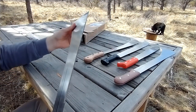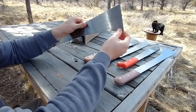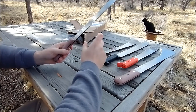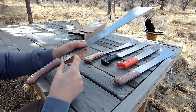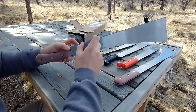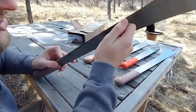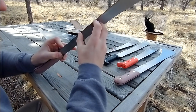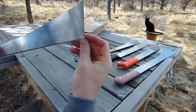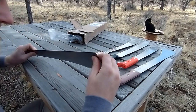The top section is not sharpened. I almost wish it had a small sharpened section on the back — I'll probably do that myself so you can turn it around and use it if needed. Look at this fuller. The plunge starts here and again you've got over an inch — inch and a quarter — between the two grinds. At least this one actually comes to an edge, though there's a section where it's not meeting and there's a big burr. The tip has actually been burnt from grinding — they went almost like a chisel grind on that side. Yikes, these are rough.